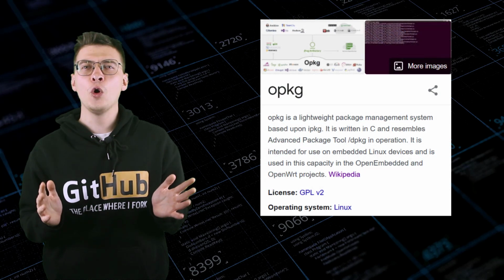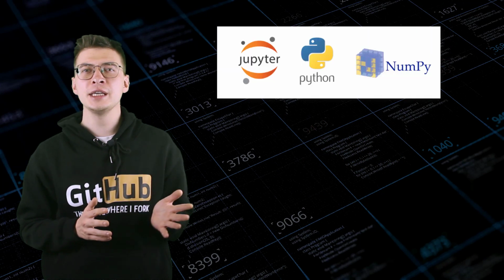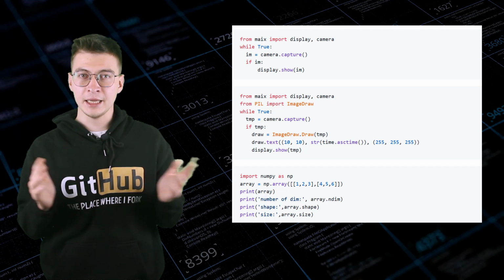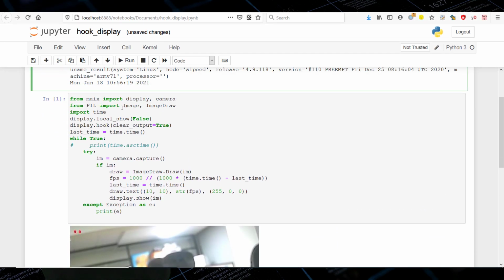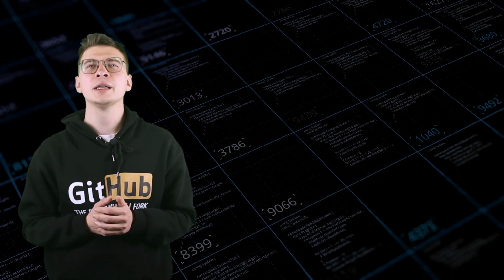There is an OPKG package source for MAIX Linux provided. Python 3.8.5 is installed as the default Python version for the system. And machine learning inference and hardware-related functions are to be integrated and accessible from MAIXPy3 pip package that you can easily download with pip install. There is also work to make Jupyter Notebook remote kernel work with MAIX-II, allowing users to connect to the board remotely using Jupyter Notebook and execute the code in notebooks.